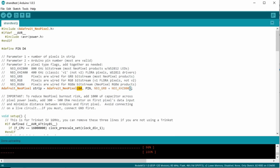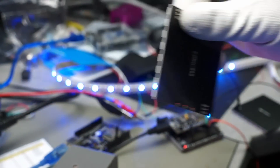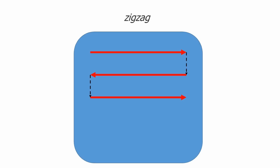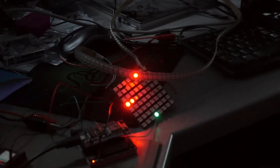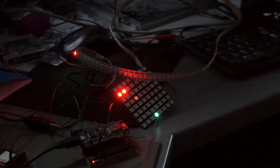I chose 64 pixels because we will later use this 8x8 panel for a small project. Using another sketch with the matrix and strip connected in parallel, we can see that the pixels on the panel are connected like the ones on the strip — just folded. Some panels use another folding technique called zigzag. When connecting the two to an ESP32, the result is a complete mess — we even get ghost pixels at completely different places on both the strip and the panel.